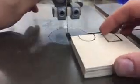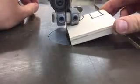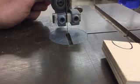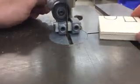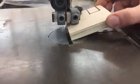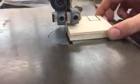What I do is I pick it up, put the wood on the side, drop it. Lift the wood at an angle. You see how if I lift up here by an inch, it goes up here just a tiny bit? And then I lock the guide, and it stays at that height. So, put the wood in, drop it, tilt it, and tighten it.